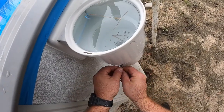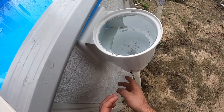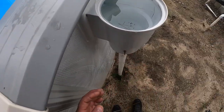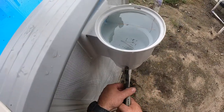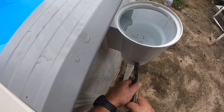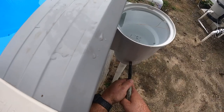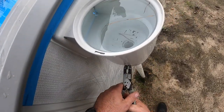This product is made by a company called Burndy — it's the only one I've ever used. Most supply houses here in New Jersey carry it. The directions say to drill a 3/16 inch hole — don't go any smaller or bigger or that post will not fit and you'll have a hole in the skimmer. Make sure you have a 3/16 inch bit before you drill any holes.